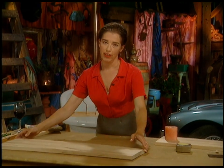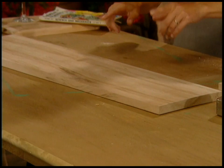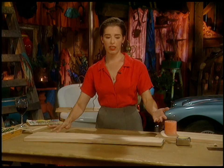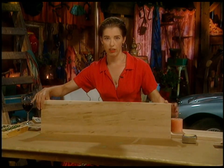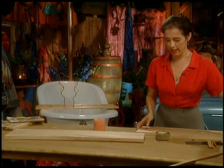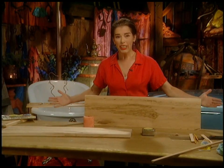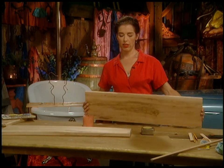This is cherry. That board was completely flat two days ago, but I've been storing it in a moist environment and it twisted horribly. So now I have to go and plane it on the corners to get it to lie down. I had to do the same thing with this board because I left it too long. So if you're going to buy cherry, don't leave it. Use it right away or clear coat it with water-based urethane so that it's sealed.